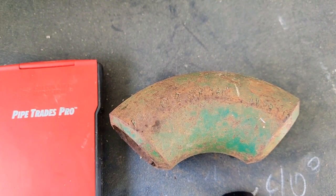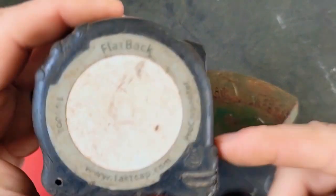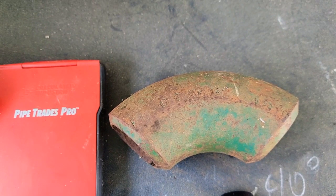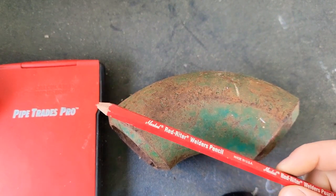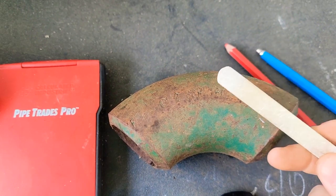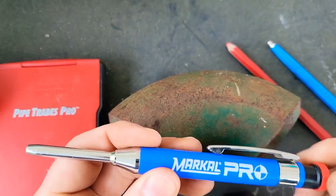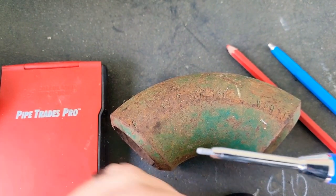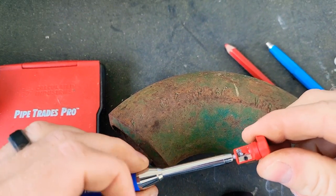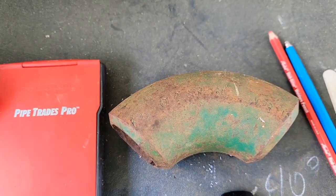I'll leave a link in the description for all these tools I'm using. I have this flat-back tape measure — it's super flimsy, it's perfect for marking these fittings out, which will be kind of tough with this two-inch one since it's so small. You got to have something to mark it with, so I've got welders pencils, a couple different kinds, some soapstone, and this one I got from Tractor Supply. It's kind of pricey but pretty cool — works just like a regular lead pencil and even has a diagonal pencil sharpener built in.